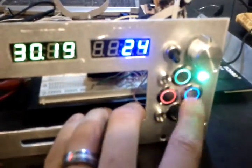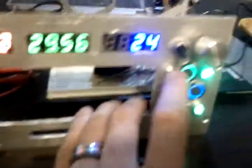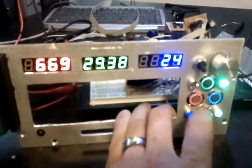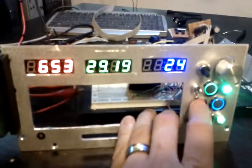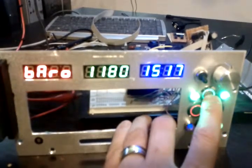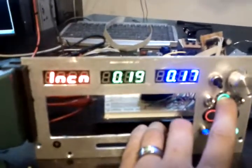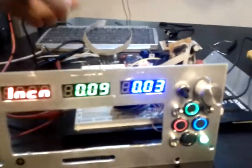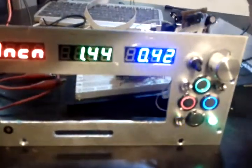All of these things are tied into buttons. There's an analog pin and a lookup table that indexes all these analog values — more on that later. There's output from the barometric pressure sensor, and the inclination data: pitch is the green display on the left and roll is the blue display on the right.